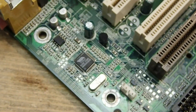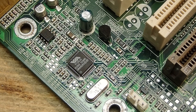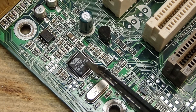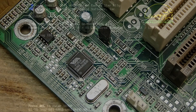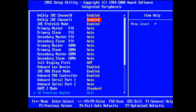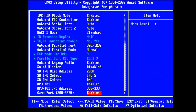Speaking of sound cards, this was the main reason why I got interested in trying out this mainboard. It has an onboard Via VT1611A sound chip for which DOS drivers are available on the internet, and I wanted to check out how that works. First of all, the onboard sound card has to be activated, and there are a couple of ways how that can be done on this mainboard. The BIOS includes the related options in the menu Integrated Peripherals.